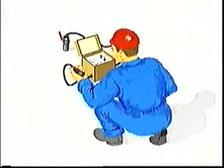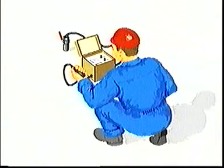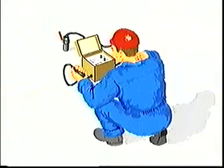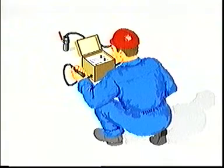The tanks are tested with an explosimeter to measure gas. When the content is less than 2%, feel safe to ventilate the tank with fresh air. Introducing oxygen into the tank can no longer create an explosive environment.